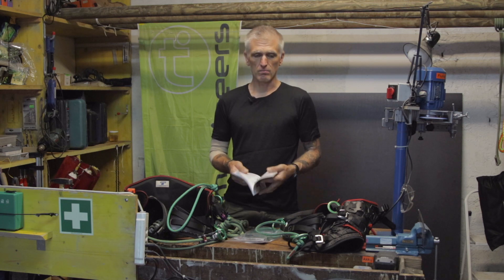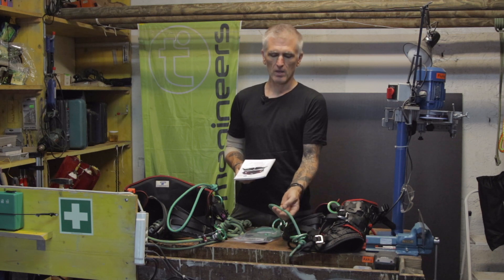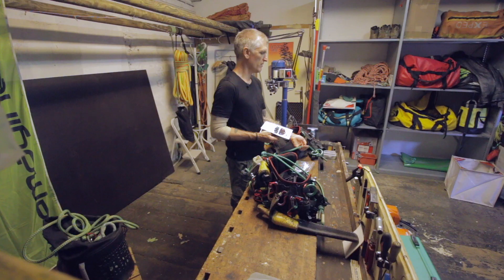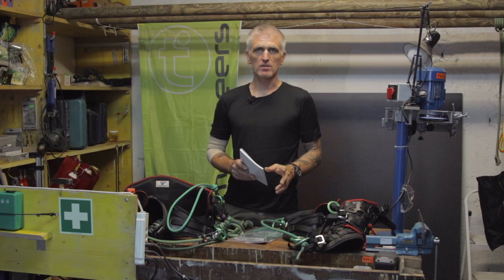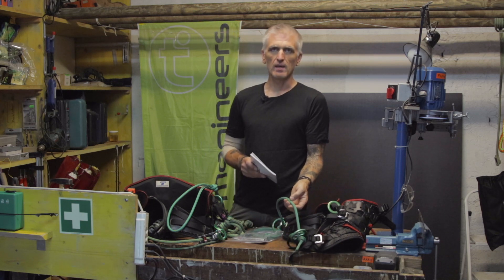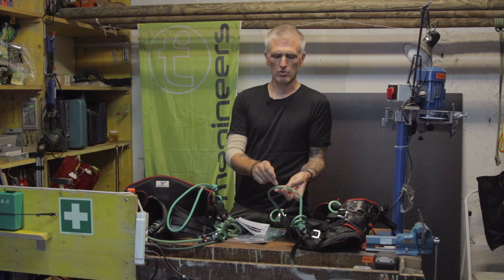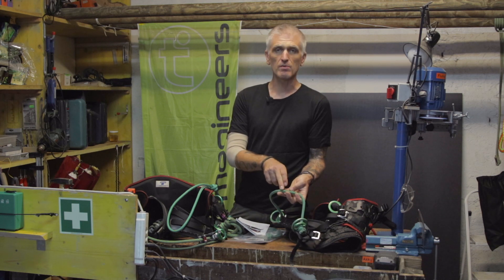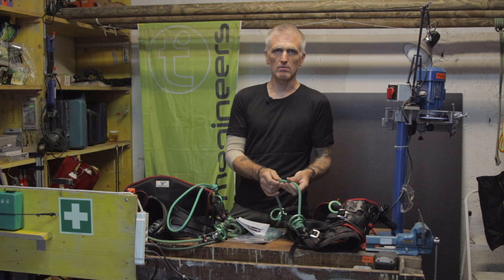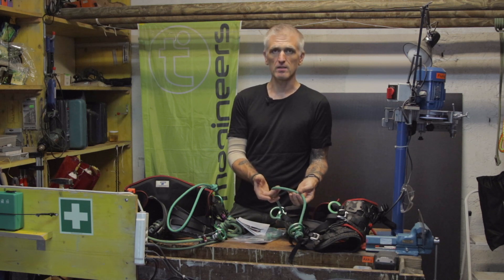So that's clear enough. There are obvious fail criteria such as a cut to the cover or severe abrasion damage. In regards to contact with hand saws, I'd like to clarify that any contact with a hand saw blade ought to be a fail criterion, because conceivably the teeth of the hand saw could puncture through the cover without leaving any visible damage and actually damage the core. So in our opinion, any contact with hand saws should be an automatic fail criterion.